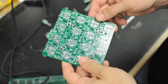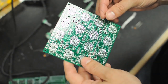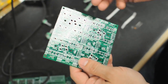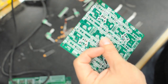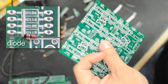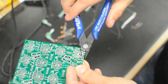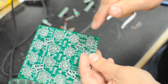The next thing we're going to do is solder our diodes. Diodes are used for the buttons so the signal only flows in one direction. You solder them from the back of the board so they don't get in the way, since diodes can be a little big. In this example, you're going to populate positions 1, 5, 11, and 15 — four diodes for four buttons. You don't really have to understand anode and cathode; just line up the little black lines on the diode with the black line on the diode diagram. Put all your diodes through from the back, solder them from the top, then snip off the excess so they don't interfere with other components.